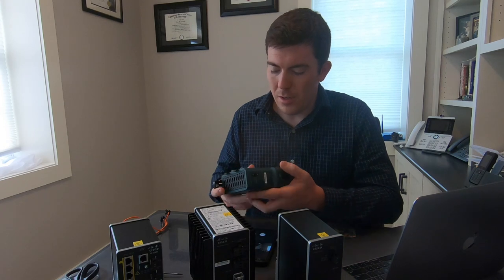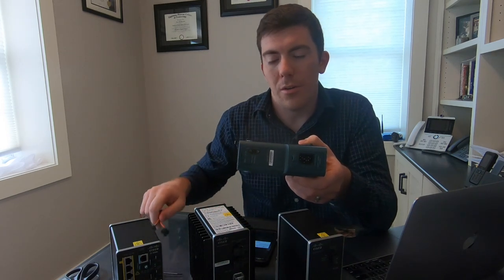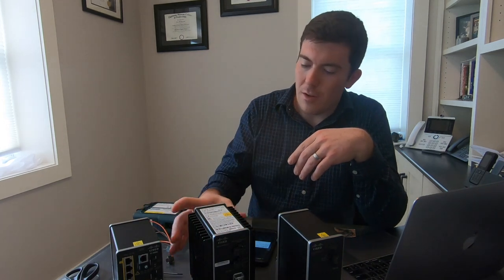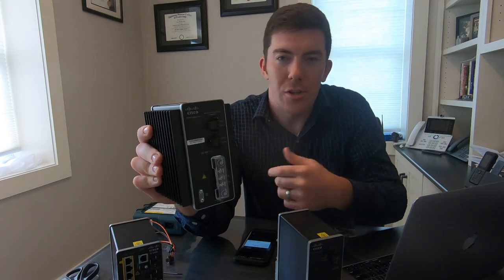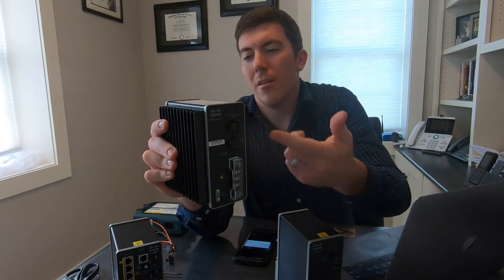This system doesn't come with a power supply; however, there are a number of power supplies you can order from Cisco. One option takes an AC plug and a screw terminal — it plugs into the terminal on the switch and that's how the DC power is provided. It works with your standard PC or switch power cord. Another option is a 170-watt power supply which has screw terminals for the AC line in, so in a panel you can connect raw AC directly. It has a shield to prevent accidental arcing and has DC outputs that connect over to the switch.